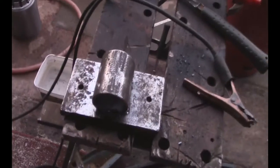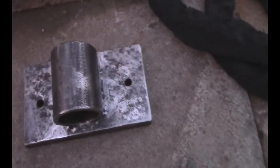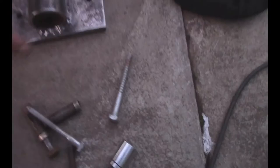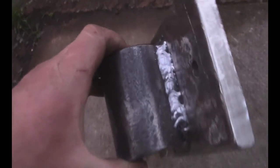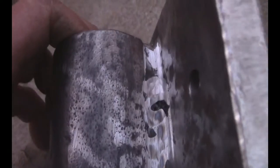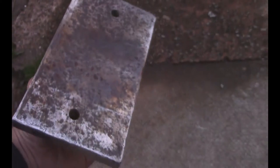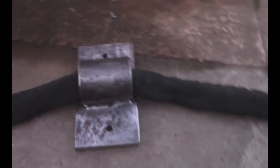Pretty much there. Give it a quick going over with a wire wool brush — electric one of course. There we go, it's all done. Still a bit warm. Maybe a spot on that corner there — yeah, the corners, let's go over them. Got some good welds, ground that one down a bit. I'll go over the corners once more — there's good penetration, you can see the colour difference all the way through the thick piece of steel. Brilliant.